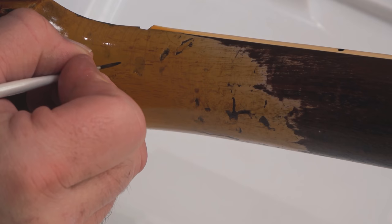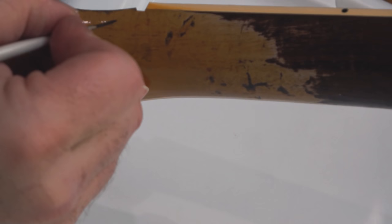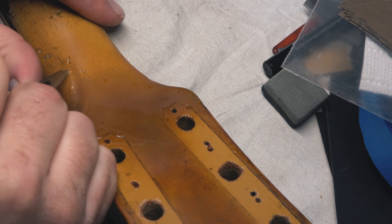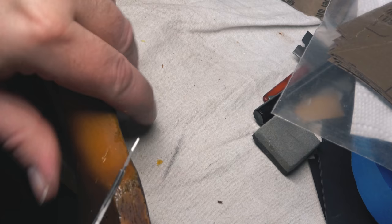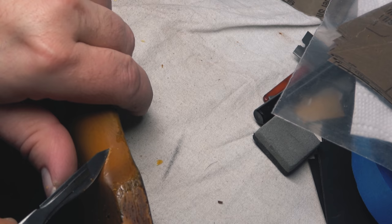Here's the finished product — we don't have the video of him going in the spray booth, but he's color-matched it perfectly as far as I'm concerned, which was probably a difficult job to do. Now he's brushing in and painting the mahogany grain lines, and that's what makes this disappear. Because this is an old beat-up guitar the paint has to match, but there were also quite a few dense dings and scratches in this area that got covered with paint. So he's going ahead and taking the paint back out of those existing dings and dents and scratches to recreate the damage — there was a pretty good one right there, maybe that's where the guitar fell and broke the headstock.